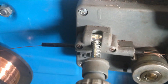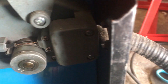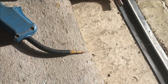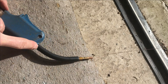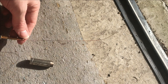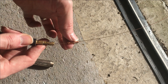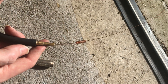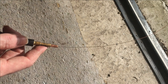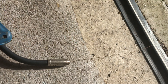When you refeed, I used gloves as well just to make sure you don't cut yourself on the wire. When you push, it should be free-flowing. I managed to push it and feed it all the way through to the end. Now, this may seem obvious if you've done welding before, but I haven't. What I did was I unscrewed here, took the tip off completely, took the welding head off, and unscrewed the little wire guide on the end. That let me then get the wire fed through this piece up to here, put that over the top, screw it back on, and then put the overall welding nozzle back on again. And there we go — it's back to normal.